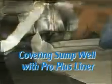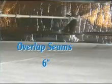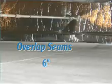To cover the sump well with the Pro Plus liner, slice the liner to allow it to go around the plumbing and electrical and over the well, as you would any other obstacle. Cover the entire floor with Pro Plus liner, overlapping seams 4 to 6 inches.